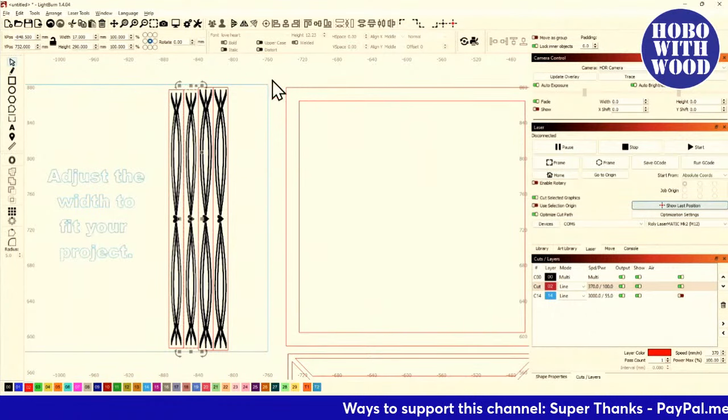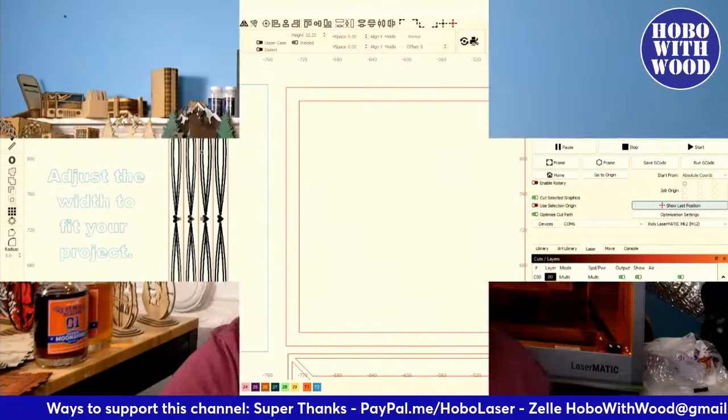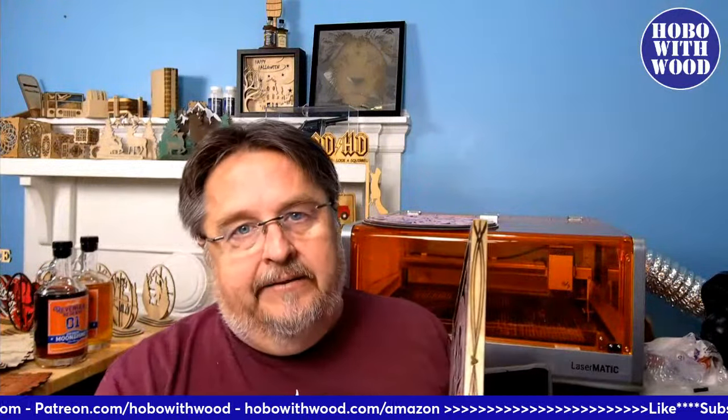But the width I've got here is 17 millimeters because the material thickness of the six pieces of my material was 17 millimeters. So the bands, you may not even want to do the bands. Some folks, I've seen Rich, he just paints his black. They already got the burnt edges on it. But if you paint the edges, you're going to have some overrun, or you'll see some overspray on the edges. So you may actually have to go back and paint them. I didn't want to do that. I wanted to cover them up and give it a more finished look.